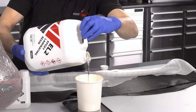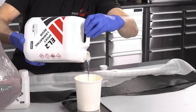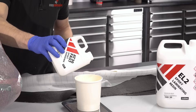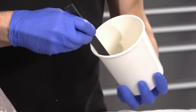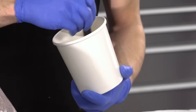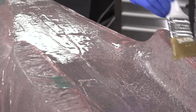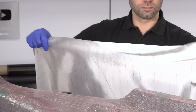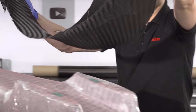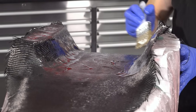The resin can then be mixed — we're using the EL2 hand laminating resin. Typically in hand layup, the fabric will use about its own weight in resin, so if you have 500g of cloth, you will use about 500g of resin. The hardener should be accurately measured and thoroughly mixed to ensure it's completely blended. When doing a hand layup like this, you should normally aim to drive the resin up through the laminate — applying the resin onto the former, laying down the peel ply, ensuring that this is wetted out, and then repeating with the reinforcement, each ply having the resin applied first and then being worked up through the fabric.